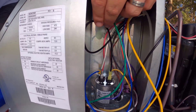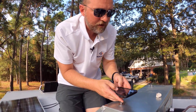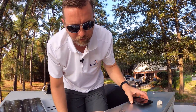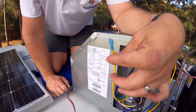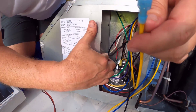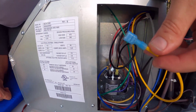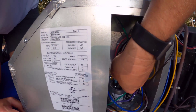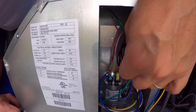We're doing good. The next step is to take the black wire and put it to where we just pulled the white wire from — which was right here in front of this yellow wire — and I'm just going to slide that onto the run capacitor. The next step is to take the yellow wire from the soft start and connect it to the terminal by the red wire on the run capacitor. So here's my yellow wire from the soft start, and here's my red wire — I just need to connect it to one of these other terminals, just like that. Easy stuff.